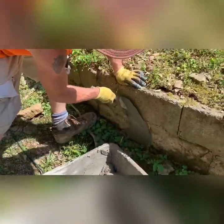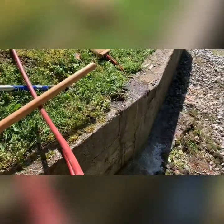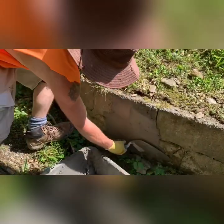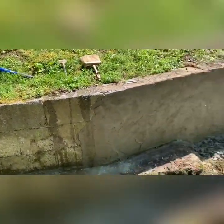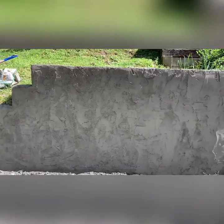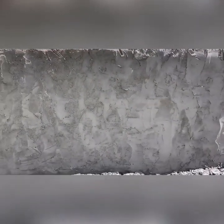Get it on the bottom of your trowel. We're trying to do something and he just lets the water go — it doesn't hurt to get a little water in there. This is what it looks like, this is the outcome. We're going for the rough textured look; I just feel like if you do it smooth, the mortar joints in the block show up. I just like it rough anyhow.